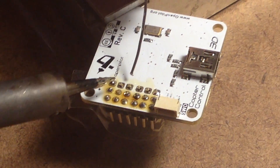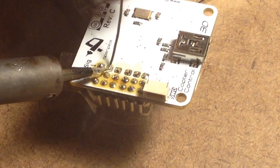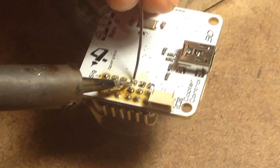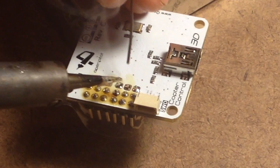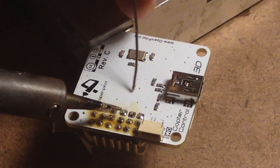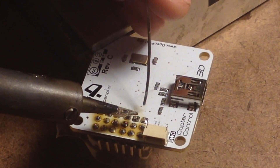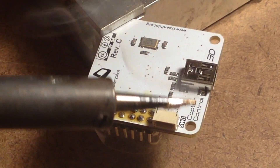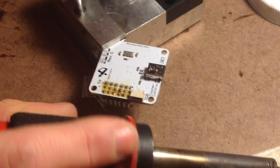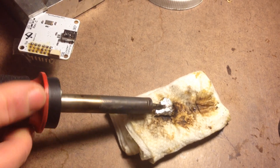Having a nice silver tip is very important because it helps transfer the heat a lot better. If your tip is a bad tip, also make sure that your soldering iron isn't on full heat. You don't want a very hot soldering iron for this because that would be very bad for controlling the heat of everything on the board when you're soldering.